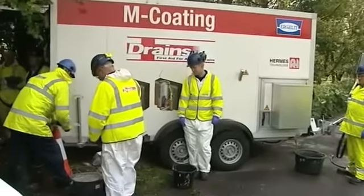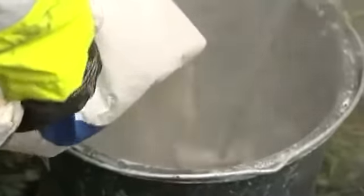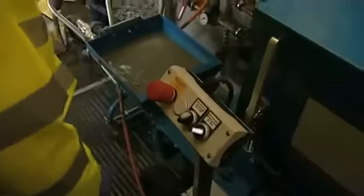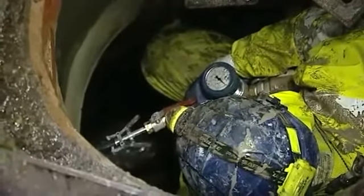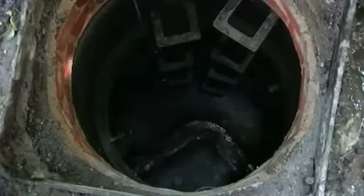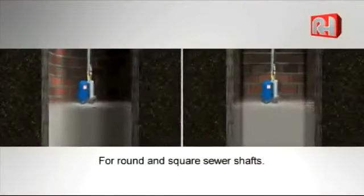That's a bit of an unknown quantity, so it's all hands on deck for mixing and feeding the pump and for keeping a close eye on the pressure as any voids backfill. This kind of mortar will start to set as soon as it stops moving, so the team works swiftly until the whole shaft has been treated. Thankfully, all goes well, and the plugs can now be cut off and sealed. With Scott above ground once more, the repairs are complete and the chamber is already looking drier than it was first thing this morning. The final part of the system is the coating process itself.